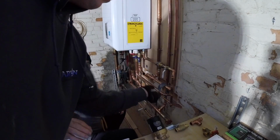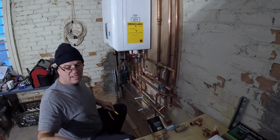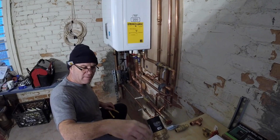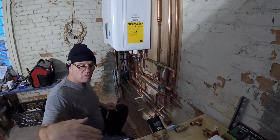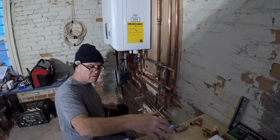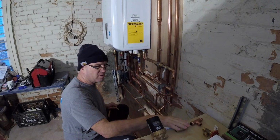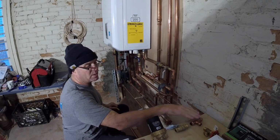I was explaining on the video that this here is going to be the basic layout, Chucky. The cold water line, we're going to cut that in now. A valve, a check valve going towards the cold water, this way the water can't back up and go in the circulating line. The pump itself, which also pulls to the cold, and a valve so you can work on the pump, etc. And then also a purge line, just like a heat line, so we can purge it.